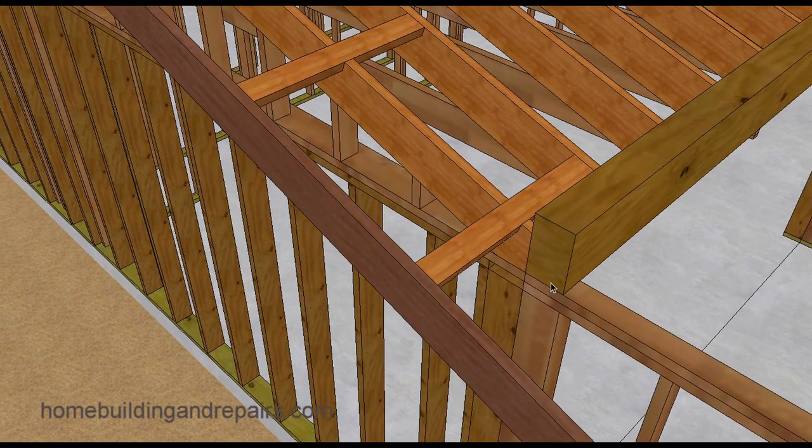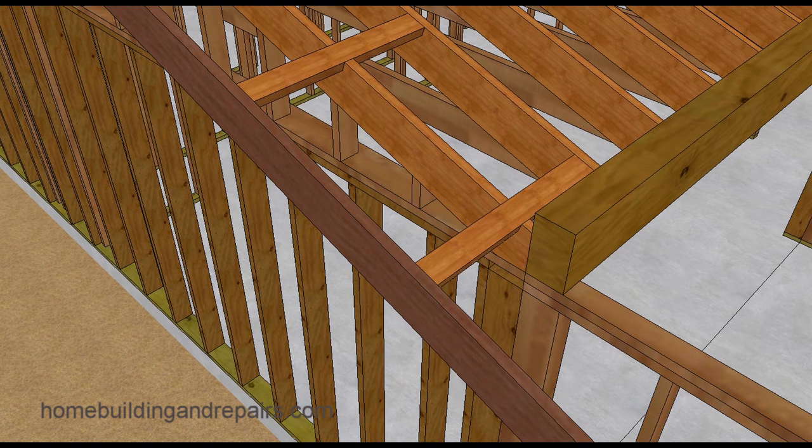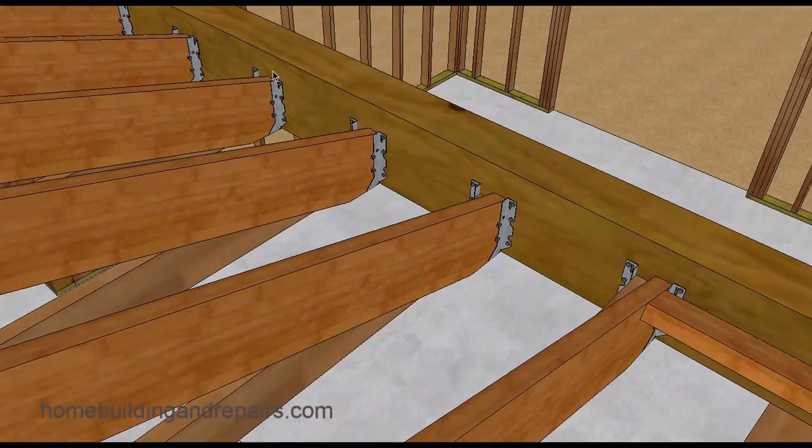The beam can be moved if it needs to — it can go in either direction, just to give you an idea. And again you can see how the beam is sticking up past the roof here; this isn't going to work out for our new building. Your beam size is going to depend upon the addition. If you have a 5 foot opening you might need a 6x6. If you have a 20 foot opening you might need something that's 8 inches wide and 16 inches tall. This is where you could get into a problem.